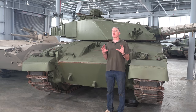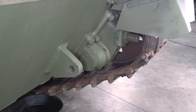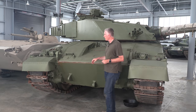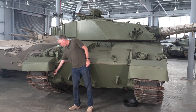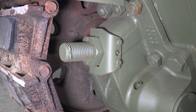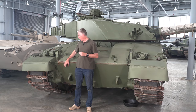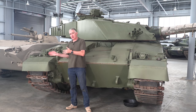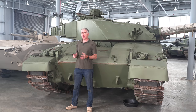This is a lashing eye — it is not to be used for towing. The manual has big block writing saying 'do not use for towing'; you're supposed to use the designated towing and lifting points, with lifting eyes on each corner. For track tension: undo these bolts, remove the locking plate, and use a really large track-adjusting wrench — it's an S-shape to clear the bow, so it is a special wrench. Once tensioned, lock it in place with the locking plate and bolt it down.